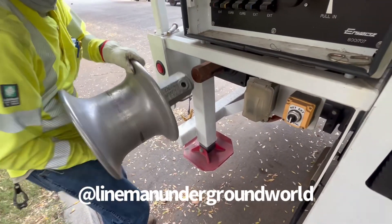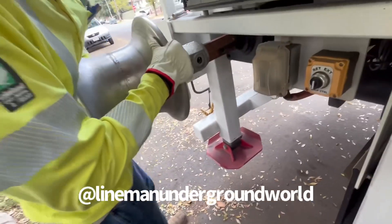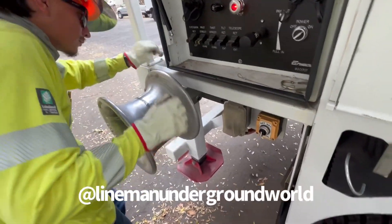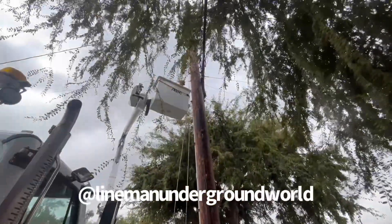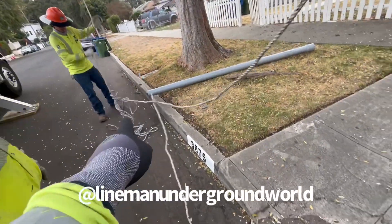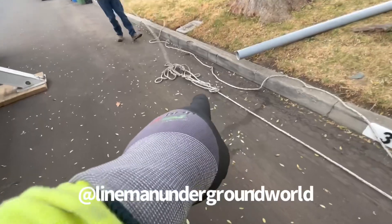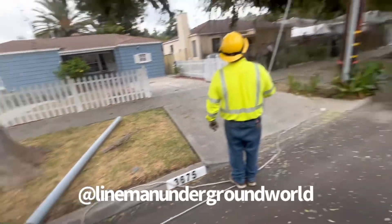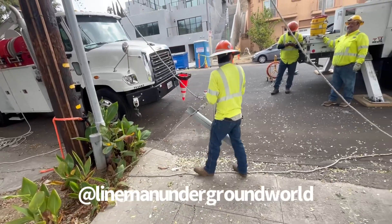Pull the pin, put it in, line up the holes — now it's locked in. Goes from here to the end of the truck, then to the pole, and then up. Make sure when you guys get headline helpers that you try to burn the rope — we call it that — in order to get all the kinks out, where it just bundles up. The rope is nice and fresh still. Don't try to burn it around a tree or the pole.